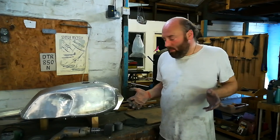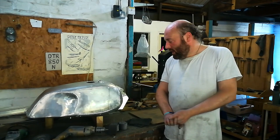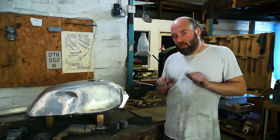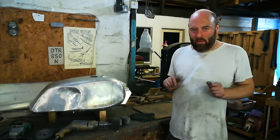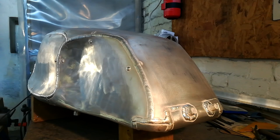The only other thing we'll be looking at as we go along: because the metal has seen a lot of heat during the welding process, there may be little bits of distortion here and there. So we'll be just gently massaging a few things back into place, probably with one of our panel hammers, just to address that. But otherwise, hopefully we're nearly there. I'm going to give you a brief demo of just cleaning up a short section of weld on the tank, just along here.